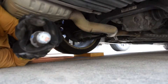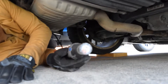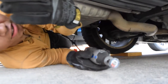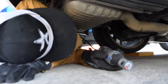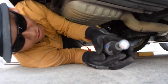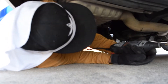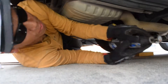I'm eating through this little disc from the Dremel — like, they're not even there, but it's making progress. Definitely get long sleeves, gloves, eye protection. Because this thing shoots a bunch of hot metal at you that burns the skin a little bit. Also, get something better than the Dremel — it's the best advice I can give.